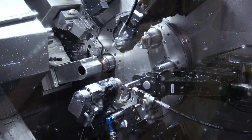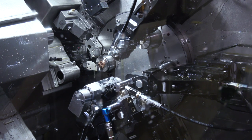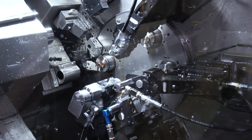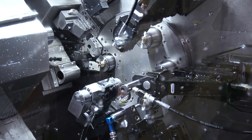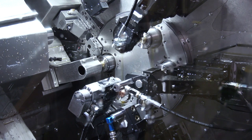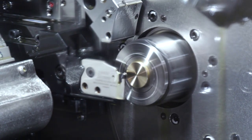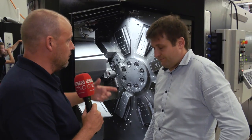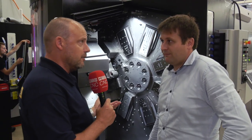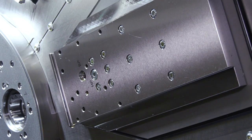That's totally correct, and it really helps our customers enter into this world — it minimizes toolwear a great deal. The principal idea behind this machine is you've got eight spindles and every spindle performs a different operation, so every rotation essentially yields one finished part. Each station does one operation — turning, milling, drilling, whatever you choose. And on each position you can mount up to four tools, so it's up to four operations per position.